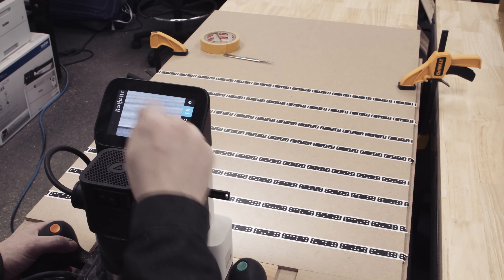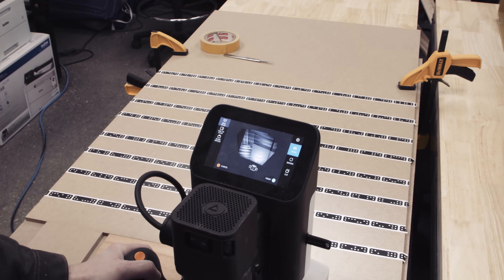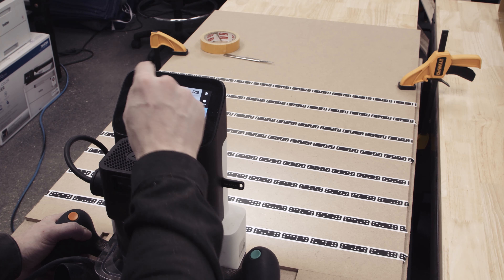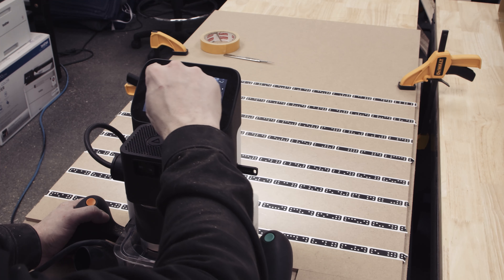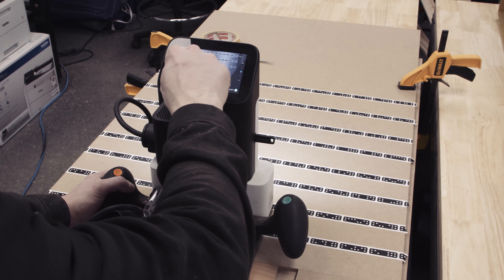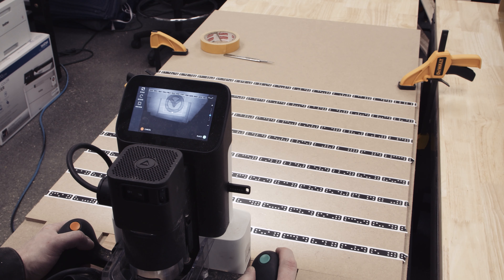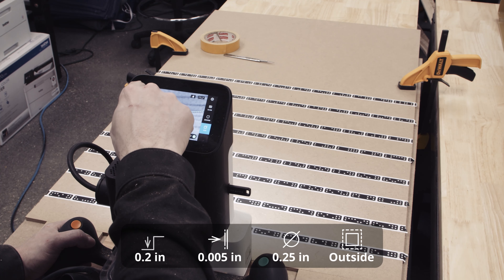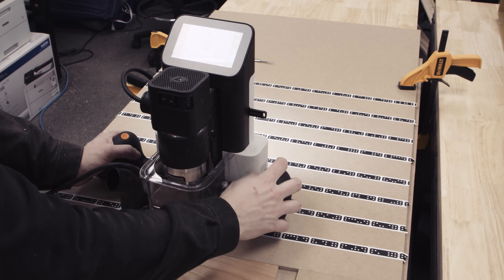The first step is to scan in the work surface — make sure you get most of the tape in the piece itself. Next I'll lay out the piece. The grain has a slight curve and would look a little better if the shape is oriented upside down, so I rotated it and reset the anchor in the Origin before placing it on the work piece. I'm starting with a quarter inch bit, cutting at a depth of 0.2 inches and an offset of 0.05 inches. Cutting at an offset outside the line lets me come back for a final cut removing only 0.05 inches, leaving a nicer surface.